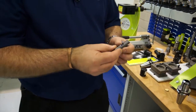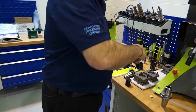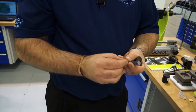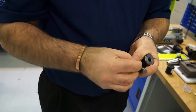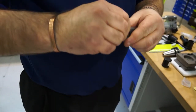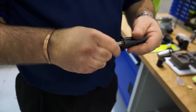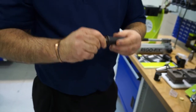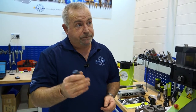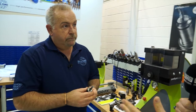That Secure Grip insert will fit onto the shank of the tool. We then insert the tool into the collet and basically screw it in. Once that's up to the stop, that tool will not come out - that is held in place. It's a big advantage being able to do it on a standard tool. When you start making modifications to shanks, whether it be fitting grooves or some kind of extra length to cater for the holding mechanism, this utilizes standard tools.